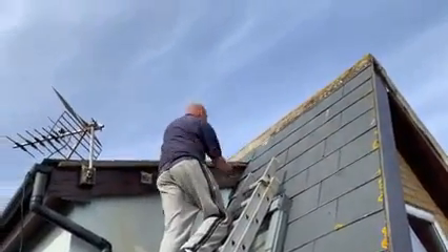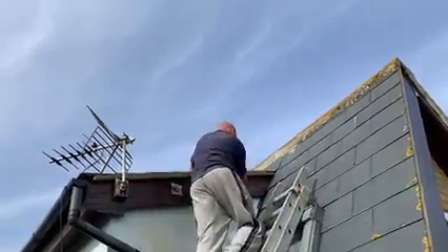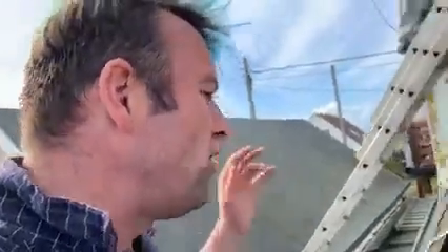So look, we have to rub this down first with sandpaper. That rubs all the old stuff off. We are now rubbing off the old varnish off the fascia, then we are going to paint new varnish onto the fascia. And if you don't rub off the old stuff, you're just painting over it and it will flake. So if you want the new varnish to stick, you need to rub it down first.